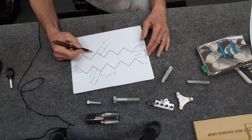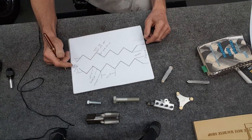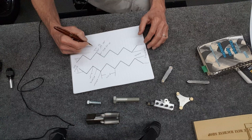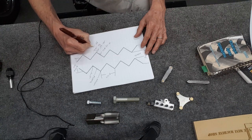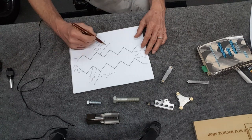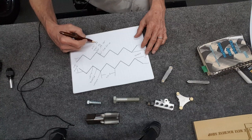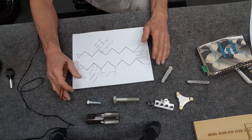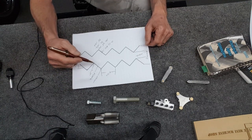Okay, so you got 159 to 164. I said 70%, and it goes just a tad smaller. It wants a 0.162 drill bit. And I'm starting to think, where are you going to find drill bits that are this kind of tolerance or size? Then for what the heck, 75% engagement, it wants a 0.160. So evidently the tables that I'm looking at saying you want a number 21 drill bit are giving better than a 75% engagement.